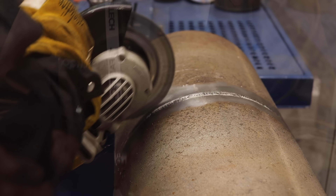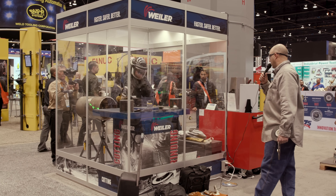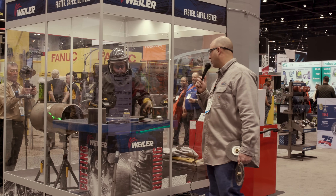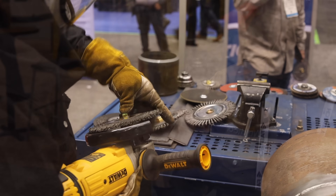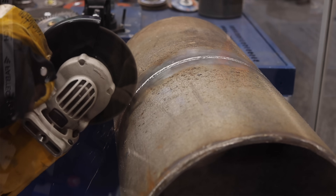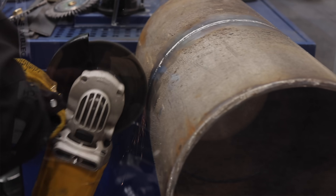As he works through these passes, he's really getting a clean pass that'll pass inspection and X-ray through these multiple passes. The next product he's going to put on is the encapsulated brush — a crimped wire brush with a lot of wire exposed, but just the tips. It holds together, eliminates any type of wire breakage, and gives a lot more aggressive clean on that piece. It's a lot more aggressive, good for the hot pass and getting in the bevel — not necessarily something you want for the cap pass when you've got to cover a lot of area. He can control the area he's cleaning a lot better — there's no flaring. If he wanted to, he could make a straight seam up and down that pipe.